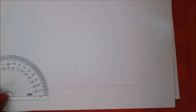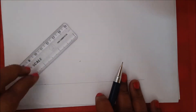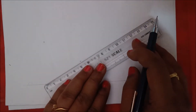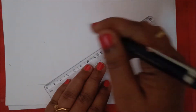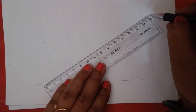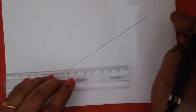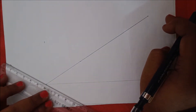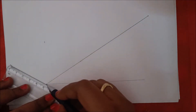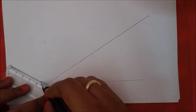After marking the angles at 30 degrees, 90, and 30 degrees on left and right sides, first draw a line on the right side up to a length of 150 mm. Using this point and this 30-degree angle, draw 150 mm, that is 15 centimeters. Again on the left side, draw a length of 50 mm using this angle point — that is 5 centimeters.